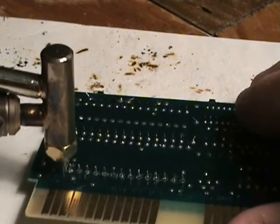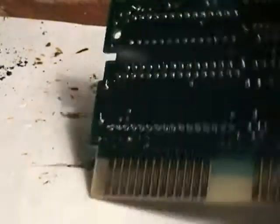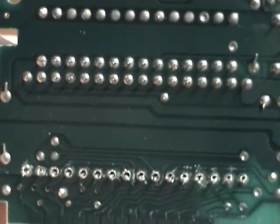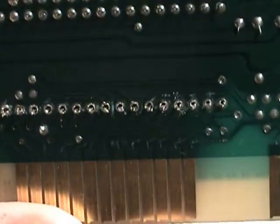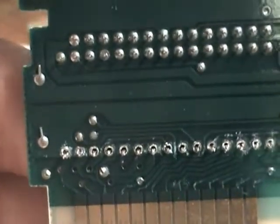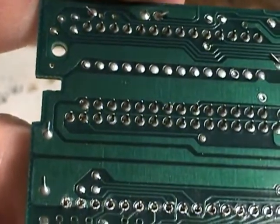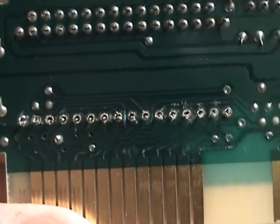So that's the kind of thing you want to look at. I got half of it done — let me show you the difference. See, there's the top row that I haven't touched yet, and then you can see the bottom row. You see how it's kind of like the solder's all missing, the drop around the legs — you can kind of see through it there. The top still has the original solder. You can see the difference.